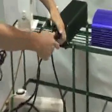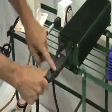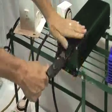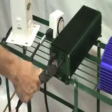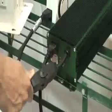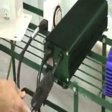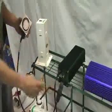From here, we're gonna plug our plug into our outlet ballast. So you never want to unplug this while the ballast is running because the light will arc and for the most part will really scare you. So you want to always keep this connected, turn your light off using your timer or unplugging it from the wall. But never unplug it right here.